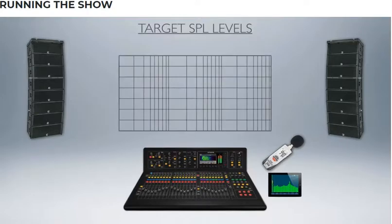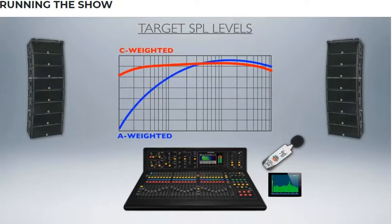The target SPL levels on these meters can be either C-weighted or A-weighted. C-weighted is fairly flat from low frequencies to high frequencies. A-weighted more closely represents how the human ear actually hears — we're not as sensitive to low frequencies as we are to high frequencies. So for a regular, moderate-level church service, use A-weighting. But as things get very loud, our ear's frequency response tends to flatten out and becomes more like C-weighting. A mistake is using A-weighting in a very loud SPL environment — that's not the best approach.